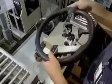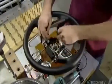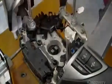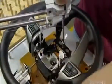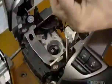After applying a barcode sticker, they route the wiring through the steering wheel to prepare it for final assembly on the automaker's assembly line. Next, they install spring mechanisms. These support the airbag module, enabling it to move in and out when you sound the horn. Then they attach the horn plate, to which the car maker will later attach the driver's side airbag module.